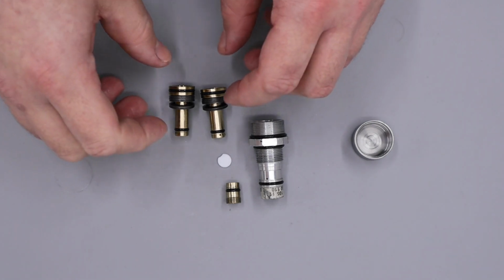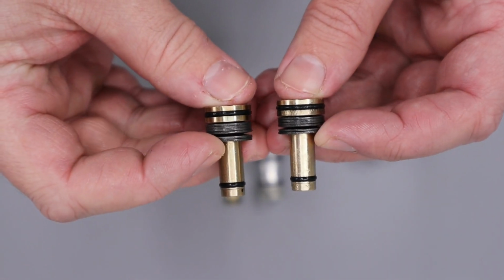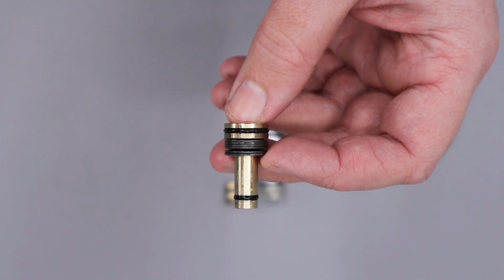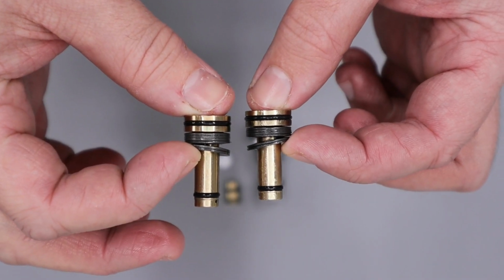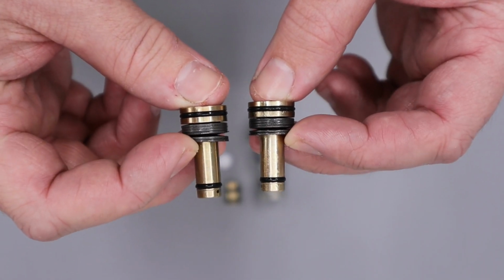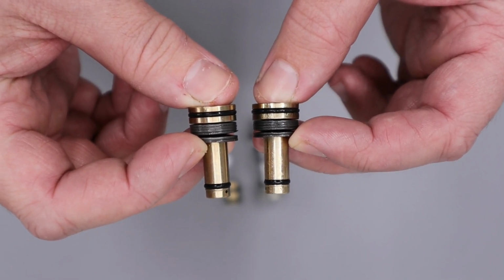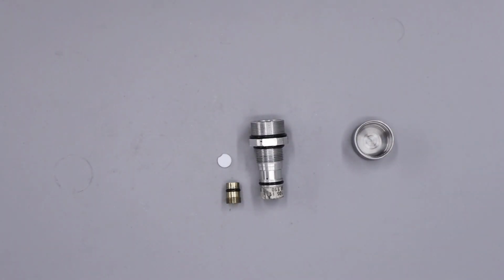With that said, the last thing I'll do before we take the O-rings off is just show you the difference between the Belleville washers. So this one here is the FAC regulators, and this one here is the sub 12 pound regulator. As you can see there, the FAC Belleville washers are considerably thicker than the sub 12 pound rifle, so that's just the difference between the washers. As you can see on this particular rifle, the stack is identical, so we have 6 Bellevilles cupped in pairs in alternating sets, with the only real difference being the thickness of the Bellevilles.